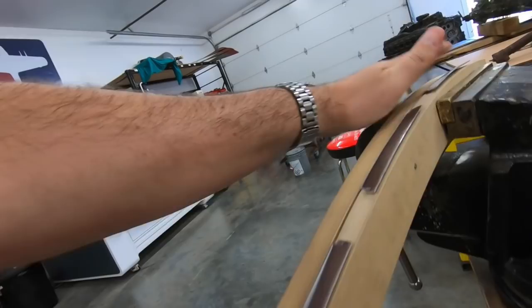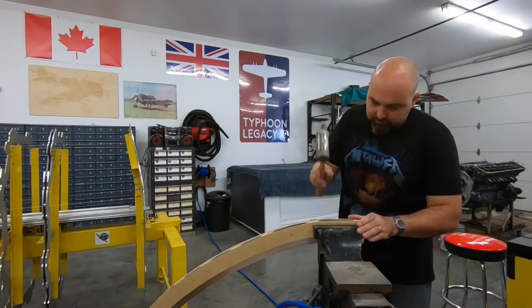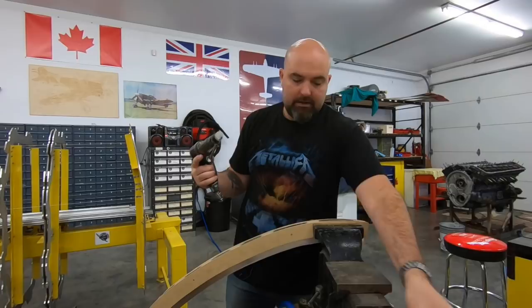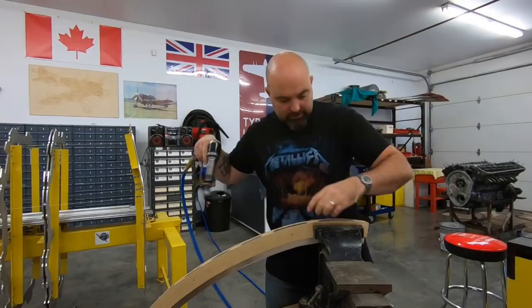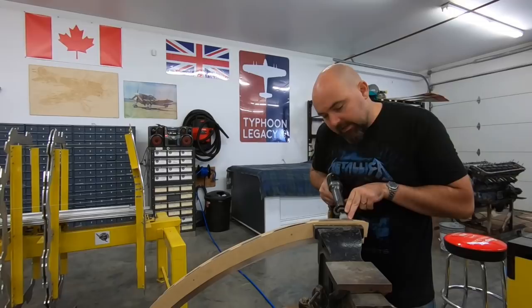Maybe I say 'we' because you're here with me. With these guys, glancing blows — you can even do a bit of a push, which works really well sometimes. And it's sitting pretty well. So I'm going to go ahead and use the rivet gun. I've got a nylon die — I have a drawer full of these and I can customize them. I'm going to use that to draw this over. I want to first tighten it up against that radius and then slowly work it and pull it over, just as I was with the hammer.